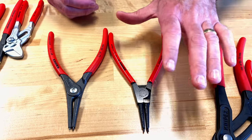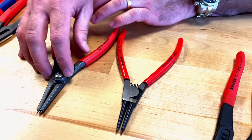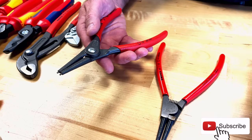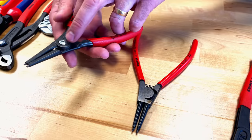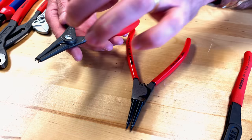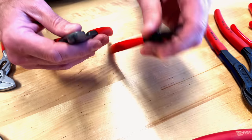This first version is forged from one solid piece all the way to the tips. The second version is what we call the precision version — also forged, but with a key difference: it has a bolt in the middle rather than a rivet. People ask, 'Isn't a rivet better than a bolted joint?' Actually, a bolted joint is more precise — hence the name 'precision.' It allows you to adjust if it gets out of alignment, and manufacturing it requires the two pieces to be lined up exactly, which is a lot harder to make.